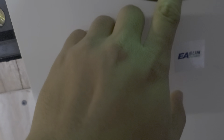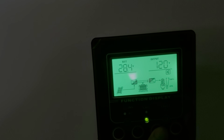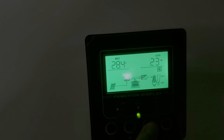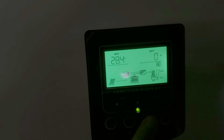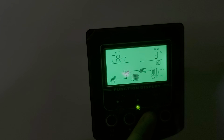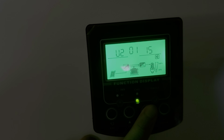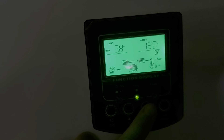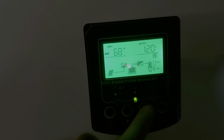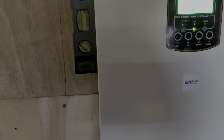It's been charging the battery well — getting about two amps now, and it goes higher when the battery is lower. With no load, the inverter bounces from four to five watts while it's on. On the solar panel side, we're getting 38 volts right now but only 65 watts because the battery is kind of full.